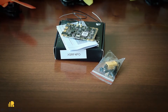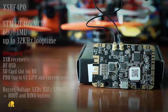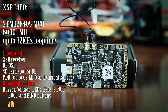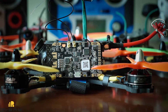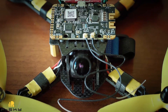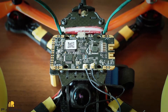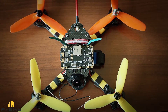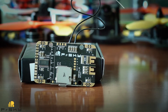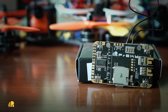The XSR F4PO is exactly the same board with the same features but additionally has an integrated power distribution board capable of 6S LiPo battery and an additional current sensor. Despite being an excellent all-in-one solution, it has a significant drawback: a rectangular shape with dimensions of 6 by 3.5 cm, which requires compatible frames. My 210 frames with regular square shape cannot fit this board inside, unless turned 90 degrees where it would protrude from both sides by about 1 cm — not very safe or convenient. But I really like the all-in-one idea for less wiring, less weight, and a very neat build, so I'll definitely have to order more suitable frames.